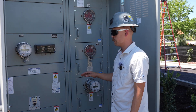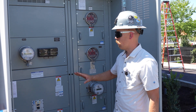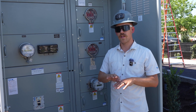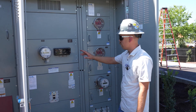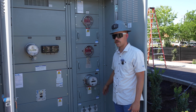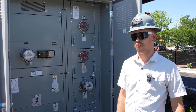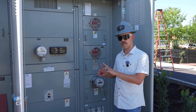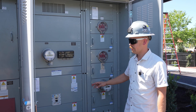The reason we have multiple meters is because the tenants that are going to occupy the inside of the building don't want to be billed on the same power bill. So the utility company and us put multiple meters in here so that each business can be billed separately from the other. In this case we have a meter here for suite 100 and panel HP. This HP panel is for the house panel, which is feeding all of the exterior lighting, landscaping power, some of the parking lot pole lights, and things like that. This one will be divided between the two tenants or paid by the landowner.